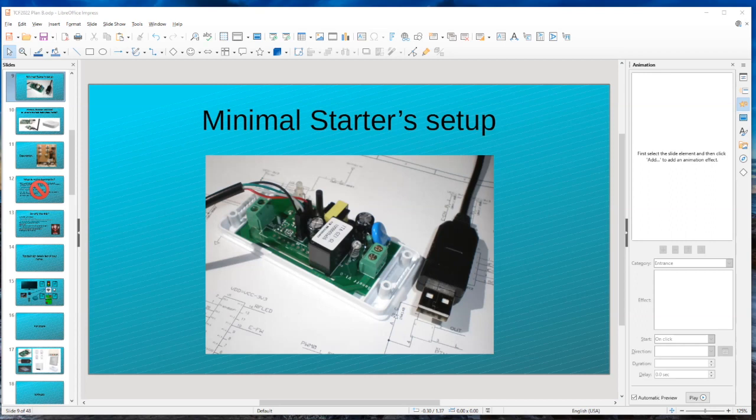It uses a Raspberry Pi. It uses Sonoff, which is Wi-Fi, which is why I have an AP on there. Because if you're going to demo, you bring it somewhere, you can't reprogram all those devices to use whatever Wi-Fi is in the building. There is also a little RS-232 cable, so I can be on the console of the Raspberry Pi in case anything really goes wrong. But I can also SSH into the Raspberry Pi via Wi-Fi from my laptop.